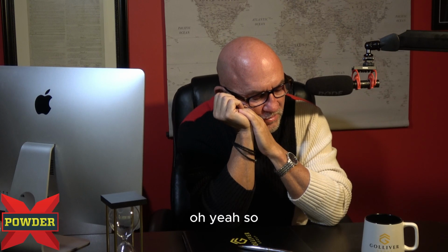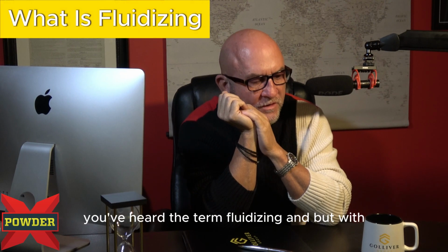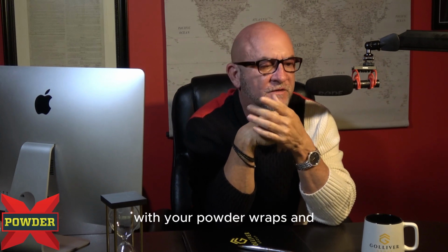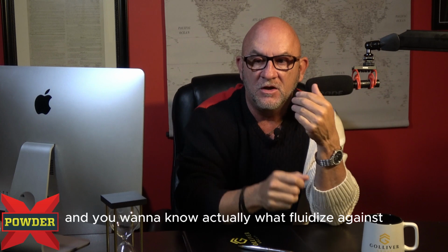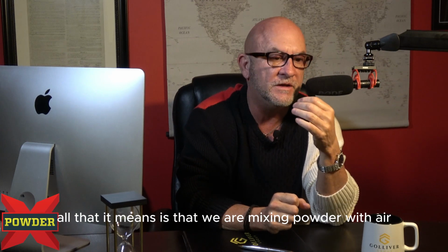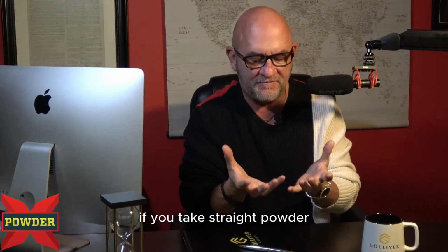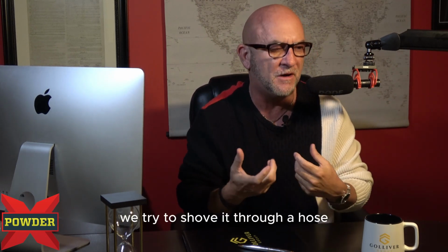Oh, yeah. So you've heard the term fluidizing from your powder reps and you've seen it online, and you want to know what fluidizing actually is. Fluidizing is pretty simple. All it means is that we are mixing powder with air to make it act more like a fluid. Because if you take a pile of straight powder and try to shove it through a hose, it's not going to pump very well.